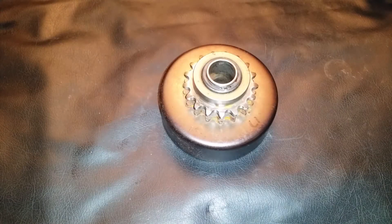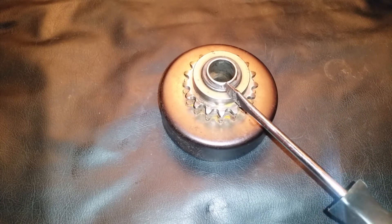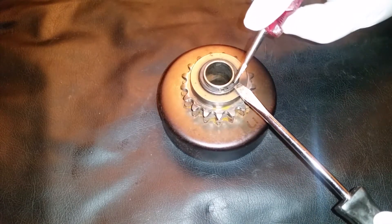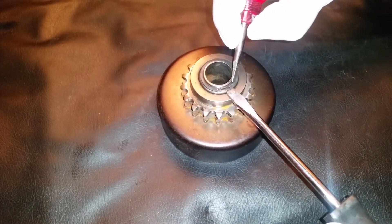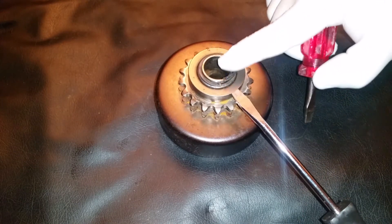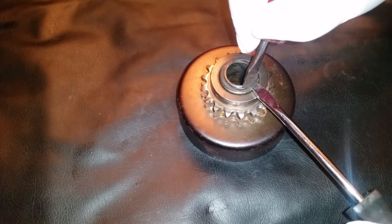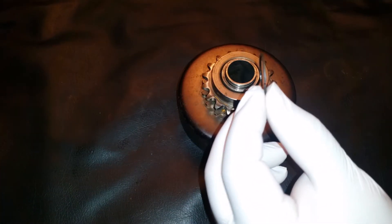The first thing I'm going to do is remove the snap ring. I do not have my snap ring pliers — I did lose them — so here is another technique I like to use. This particular snap ring has an indentation near the sides, so I like to use one flat blade screwdriver to push it out and the other to push it up. Get one edge over the top and then do the other, and it should remove quickly and easily without flying across the room. There we go — nice and straight.